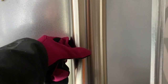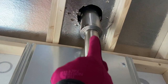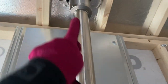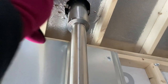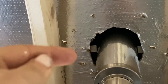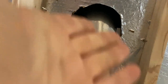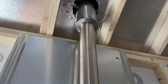The smaller stove pipe is double-walled and goes all the way up through this bigger insulated pipe. Both the smaller pipe and the insulated pipe go through the roof. In this hole you can see the metal L-brackets that are attached to the insulated pipe and then to the top of the roof. All the black you're seeing is underneath the boot - that's just air space underneath the boot - and I'll show you up at the top what that looks like.